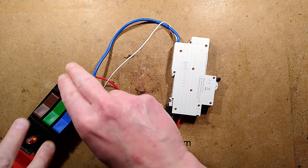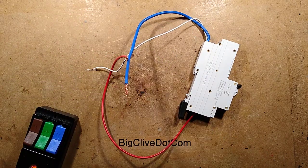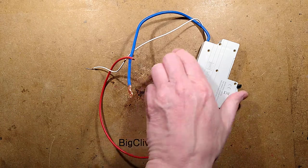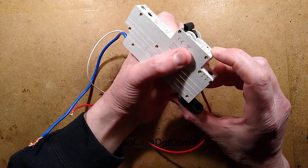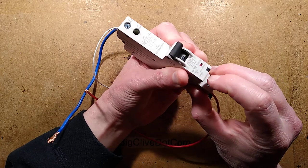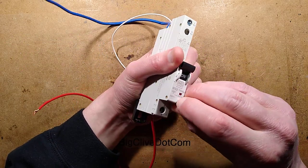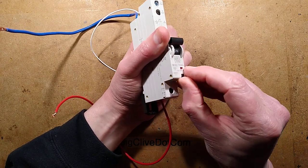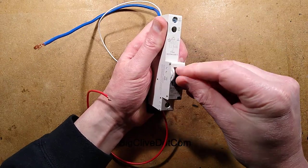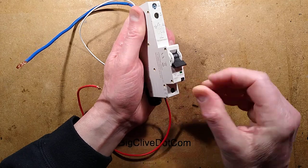Okay, let's unplug it. Let's open the thing up. Let's explore why that button was jamming. I don't think it's dust or dirt, because when you ping it, it does eventually come out, but I think it's actually a rag of plastic around this. There is a slightly rough plastic finish around that, and I think that's what's jamming it, so it might be common. So if you have one of these circuit breakers and it won't set, it just keeps tripping instantly, check this little button is poking out, because it should poke out.